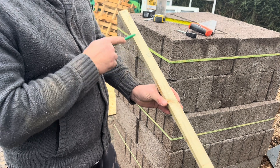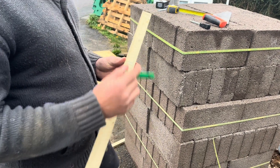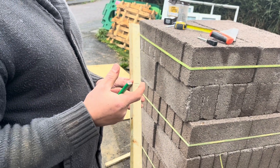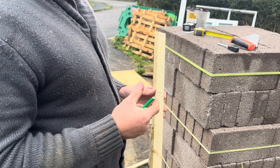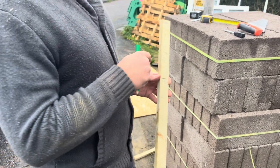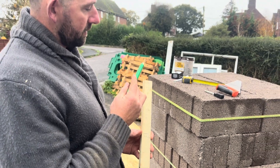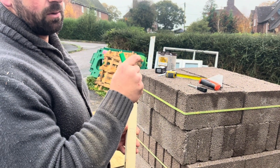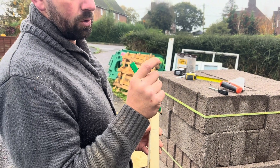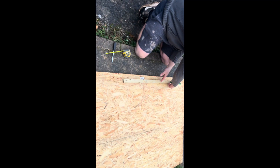We know it's a 215 brick, which gives us the extrados and intrados. I'm going to start with the extrados line, because if you've got a 70mm imperial brick, that is your limitation for the maximum size of your voussoir. With a semicircular arch you need a key brick, so you need to work out your extrados to get an odd number across the whole semicircle, and work out your maximum brick sizes.